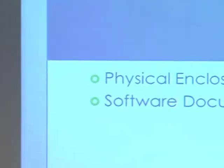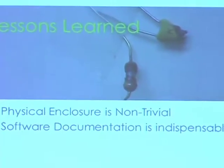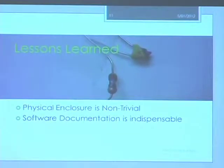One thing I ran into with the embedded software was the importance of good documentation. We used the Rabbit microcontroller, which is an excellent microcontroller with all the features we needed, but because the company has been reacquired, finding accurate and up-to-date documentation for it is often difficult, so figuring out certain things took trial and error. We also could have easily derailed if we hadn't specified ahead of time how we wanted to send data to and from the computer and microcontroller. Getting a high-level language to talk to a low-level language was rather tricky and required some interesting techniques.